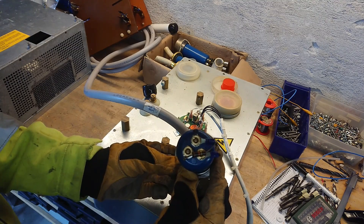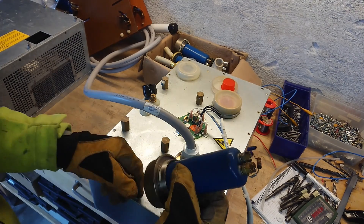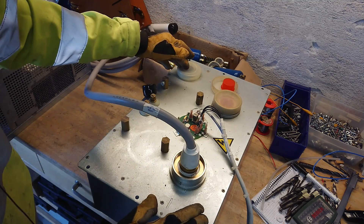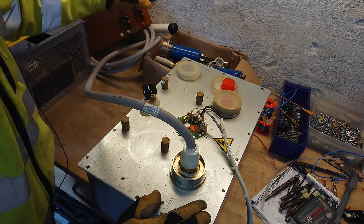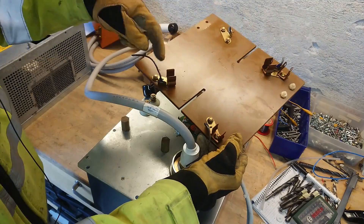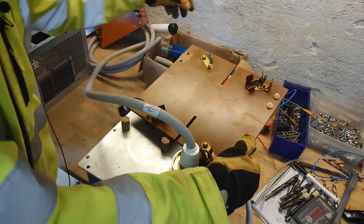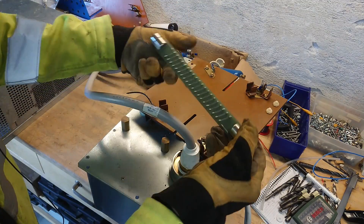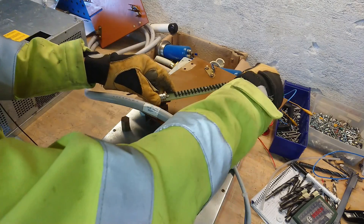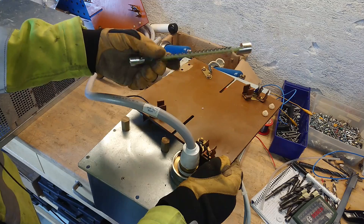The plug on the inside of the transformer has three connections sitting close together and actually has a resistor mounted between two of them — I'm not sure if it does some kind of identification between the pins, and I do not know what's inside the plug itself. The tank voltage output is kilovolt DC because the tank has internal rectifiers. This is a rectifier mounting board that takes four arrays of diodes — high voltage diode arrays like this. They connect into large fuse holders, and that's all submerged in oil, so insulation is not a concern.